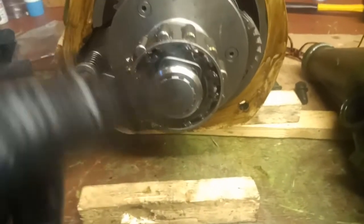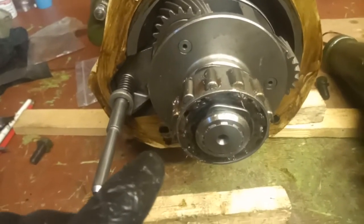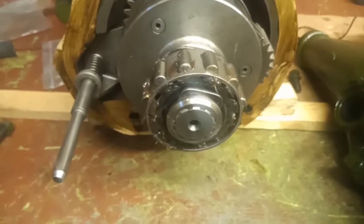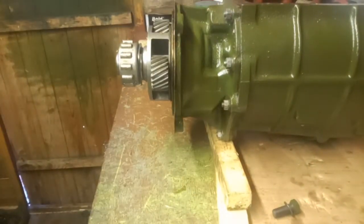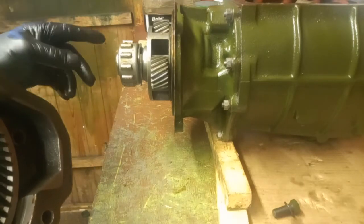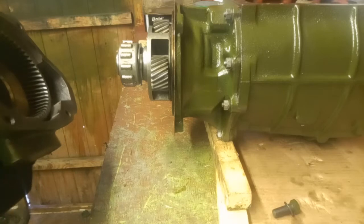This is apparently quite a tricky job — I've reassembled it twice now and never had a problem. Because I'm making a video it might go a bit wrong. I'm going to paste this rather heavy sun gear onto that pin first, making sure it engages with the spring inside and making sure none of these needles drop down, because that will stop it from going on. Here we go.